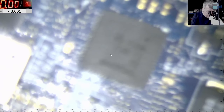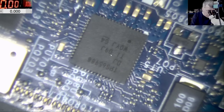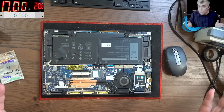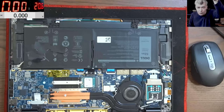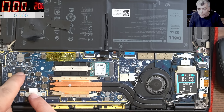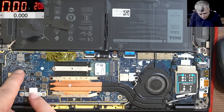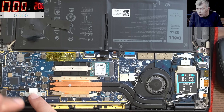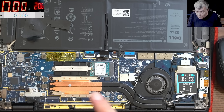That chip is a TPS chip. Two days later and I just got the chip. So one more time — we have to replace this chip because it was getting hot, and on the 3.3 volt power rail I had only two volts. I came with the power supply and nothing was shorted. This chip is supposed to supply voltage, so let's replace it quickly.